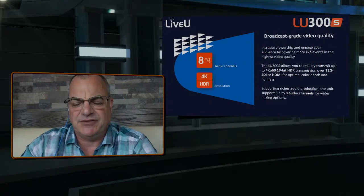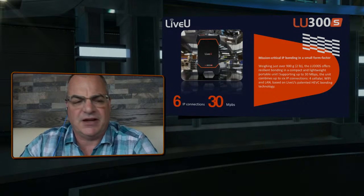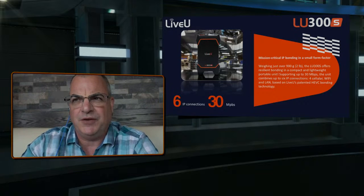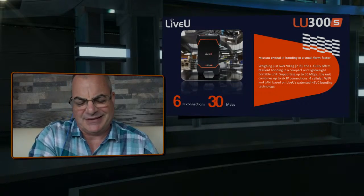Yeah, well, you've also got HEVC encoding. You've got control over the bit rate. So the LiveU Solos are only going to encode to a certain level that is what's acceptable by YouTube, Facebook, and things like that. You've got control over this. You've got that HEVC encoding, which means you're going to get higher quality video at lower bandwidth. So for the same amount of data that you would send an H.264 video, you're getting a much higher quality video at that same data rate. You've got that scalability. If you're in someplace, 5G is a biggie. 5G is better at penetrating in certain locations. So the units are not just 5G, they're 5G and 4G, so you're good in either location.